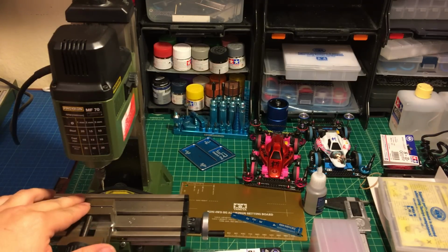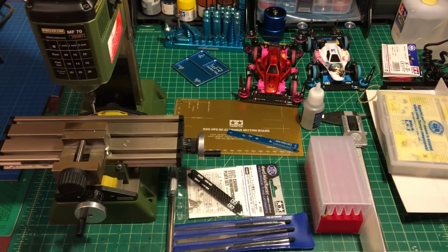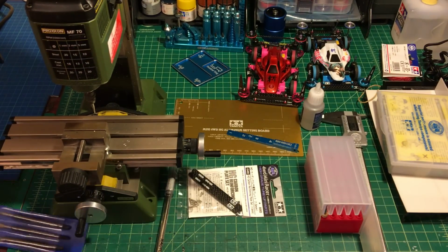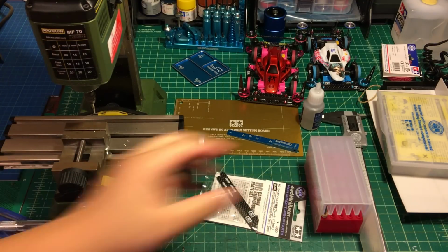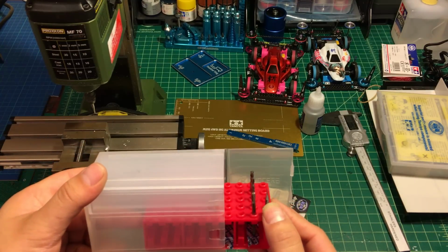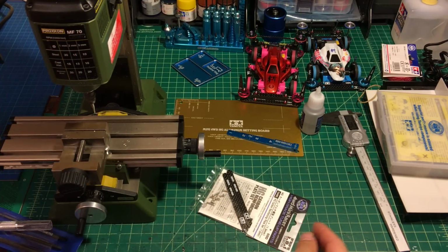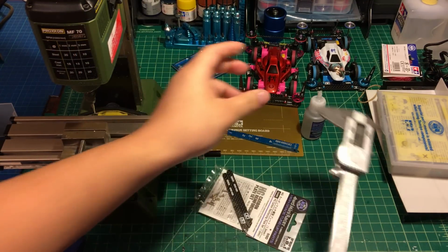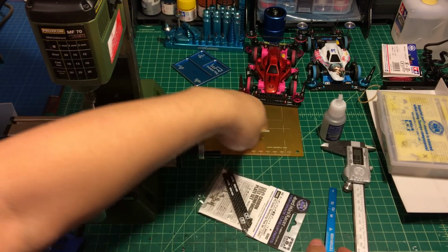Make sure you have the machine vise which is attached to the micro milling machine. The tools you need for making the stabilizer also include a set of files, and the pencil knife which is right here, and different sizes of cutting bits. So you need a 1mm, 2mm, and 3mm. This is also for the micro milling machine. And make sure you have the digital caliper, and the crazy glue, and a gauge right here, and a setting bar.